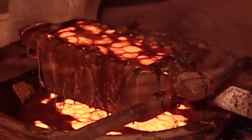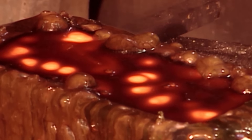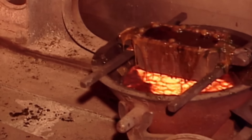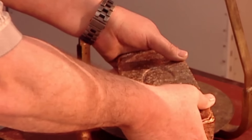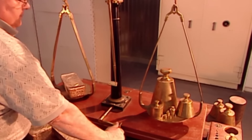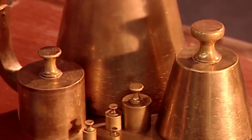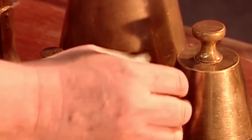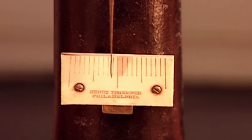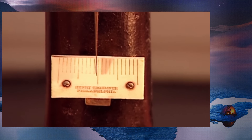The gold takes about four minutes to solidify, then another hour to cool completely in a basin of cold water. The gold bars are extracted from the moulds and cleaned of any slag residue. Gold bars are also called ingots. At this stage the gold is 80% pure. The mint will then refine the gold to 99.9% purity — the international gold standard.